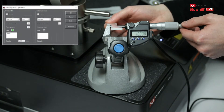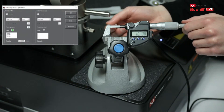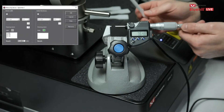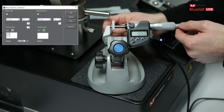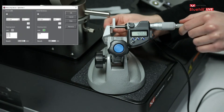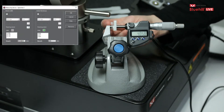Take a second measurement at the middle of the specimen and press the button, then a third measurement toward the top end. Once the software has all three readings, it automatically jumps over to the thickness portion. This time I'll use the foot switch: tighten down on the thick side until it clicks, press the foot switch, and the measurement populates. Take the second and third thickness measurements the same way, and you're done.